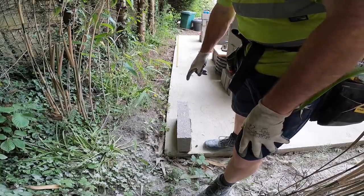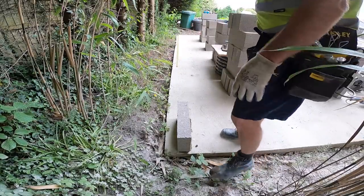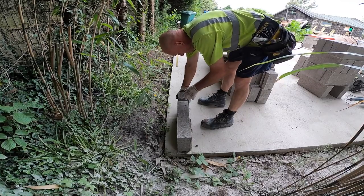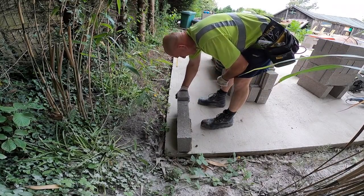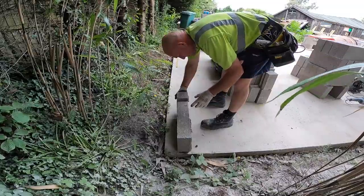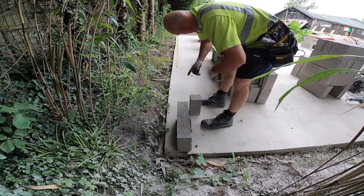Corners. Sorry. Right, so it's block to a block that way, but it butts up like that, so there's no room for that, which is a bit hard to explain, right? So when we come over the top of the next course, we have to cut 3/4 to kill our bond on that corner.